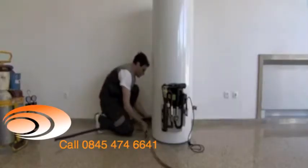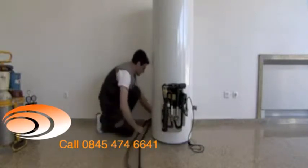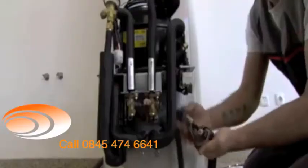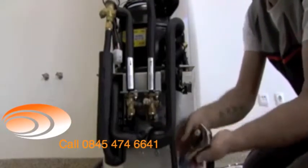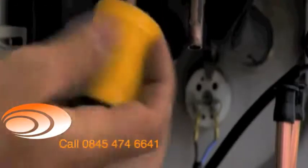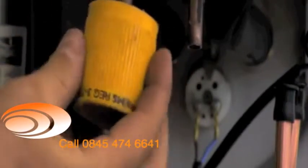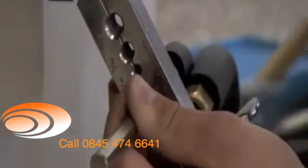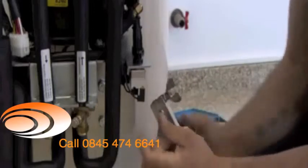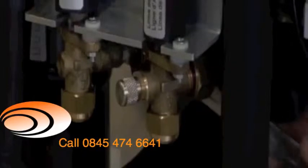The connection of the pipe to the block should begin with a correct measurement of the pipe's length. Use the pipe cutting tool to cut the tubes at the exact point of connection. With the reamer, remove all existing burrs without forgetting to replace the cap. Repeat the steps to flare the ends of the pipes, remembering to place the nuts on the pipe side and remove the copper caps. Tighten the nuts, initially by hand and finally with a wrench.